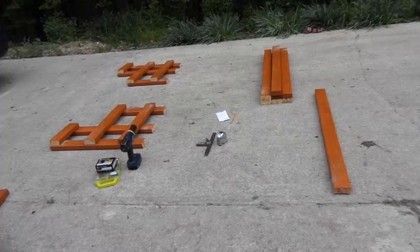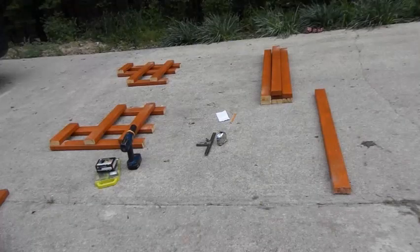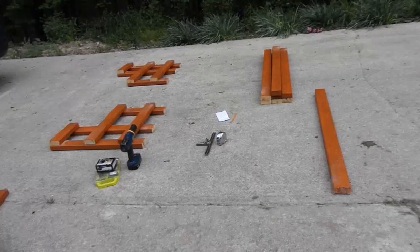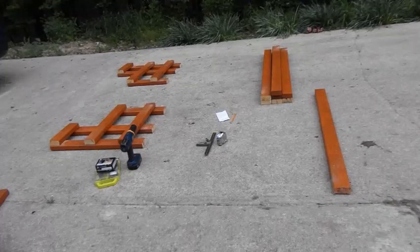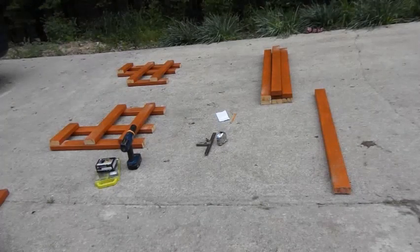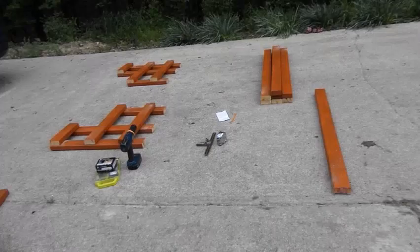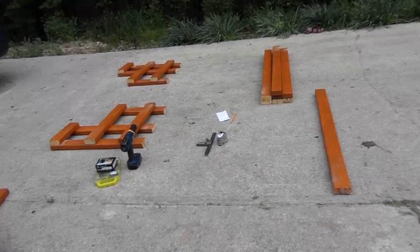The 31-inch ones are the ones on the very end with a 12-inch at the top. And then the 25 and a half inches are the long ones going horizontal to meet the 19 one on the end. And you make 2 ends that are mirror copies of each other. And after it's all said and done, I will be painting the ends with the same color paint to seal it good. So, off to drilling. Turn it off so you don't hear the noise, and we'll be back.